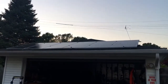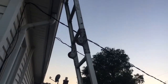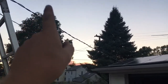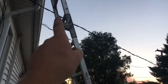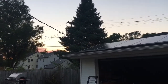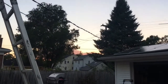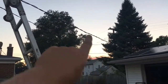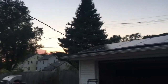I got three hooked up so far. There's a solar panel wire going through. If you're wondering how I had that hooked up, there's actually a piece of wire running through that, so no weight is going off this wire. It's like 12-gauge tie wire that's keeping and holding the weight, so no weight is being carried by these solar panel cables. All weight is being carried by the wire that's holding everything up.